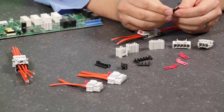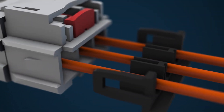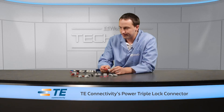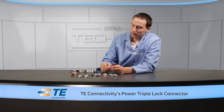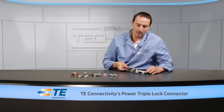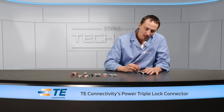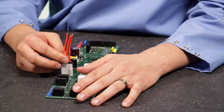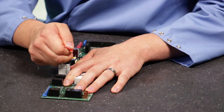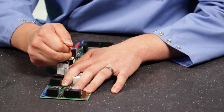The way TPA works is that these black half cylinders press up against the terminal inside the connector to ensure it does not move and does not dislodge. In practice, this looks to me like it's probably a control board from a dryer or washer. If I push this in and connect it with the CPA, I cannot disconnect this — the connector is actually starting to break the PCB before it comes apart.